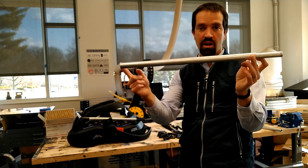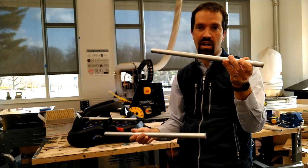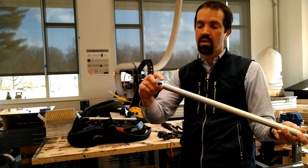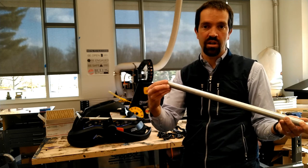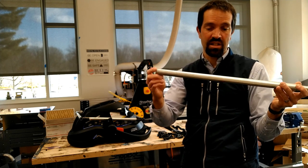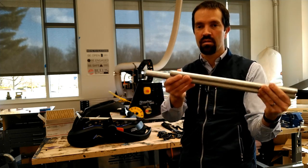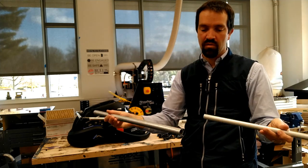This three-quarter-inch conduit on our design is 19 inches long, and the half-inch conduit comes about four inches short of the top. You can always trim off the top to make your design shorter. Different wheelchairs and different people will need different heights, but 19 inches is a good place to start. Going about 15 to 16 inches on the half-inch pipe will work just fine.